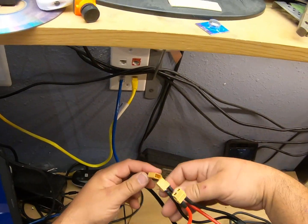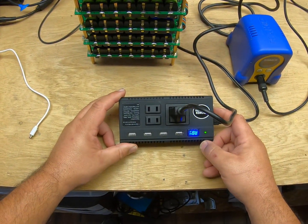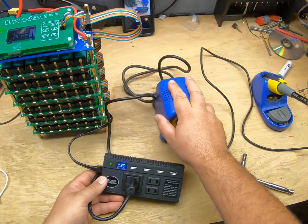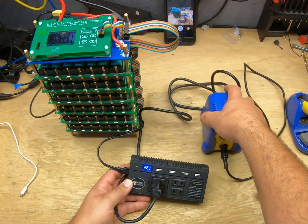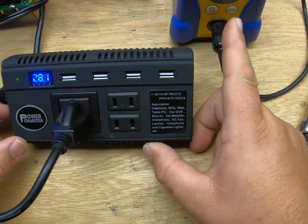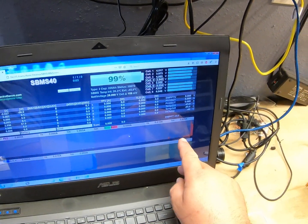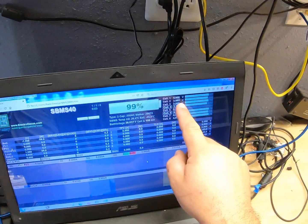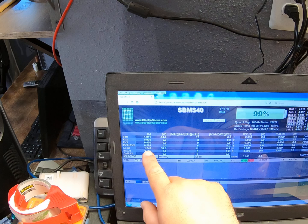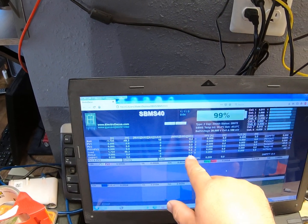We're connected. Now I'll hook up a load — a small 130-watt inverter for testing. Making sure I'm on the load pins, I plug that in and power up the inverter. It also has a battery voltage meter on it. I've got my soldering iron plugged into the inverter. This soldering iron draws slowly enough that it'll power up fine. Set for 750 degrees — and you can see on the screen where the power just jumped up suddenly, with individual cells shown.